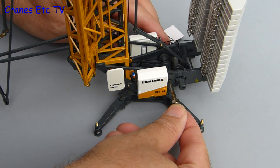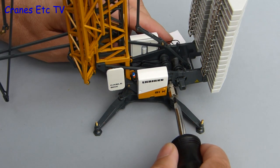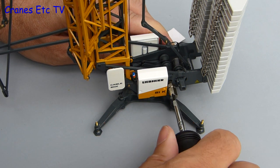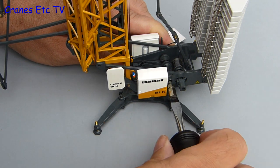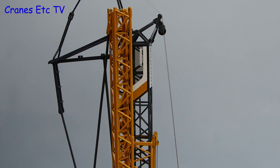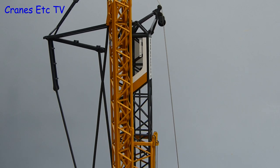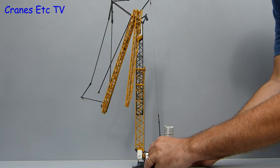To start extending the tower you insert a special key into the winch drum, and because it is fiddly and stiff to turn by hand it is best to use a screwdriver in the slot at the end. Then, with a song in the heart, you can start screwing away. This winds in the rope system and the tower begins to extend. At a certain point the guides that hold the jib kick in and the jib starts to unfold.